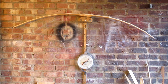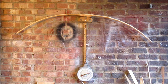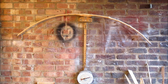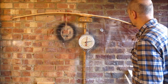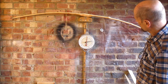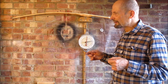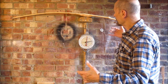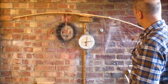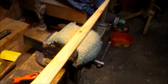That shouldn't go bang — I reckon I could probably pull this straight back to 28, maybe even 29, but I ain't going to try it. I'm getting a bit tiller blind now. There's 26 now — that was interesting; I'm going to review that because I think this needs to move more out here. But 26, that'll do for now. It's easy to end up tiller blind — a little bit here, a bit there. Back away, have a cup of tea, decide: am I going to spoil it, do I just clean it up, varnish it and shoot the thing?